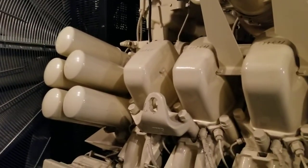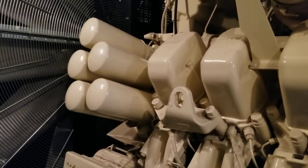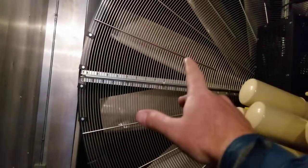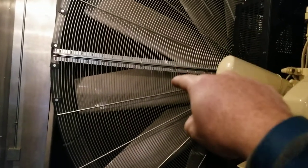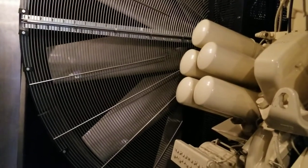Three megawatts is enough to feed probably at least 300 homes with all lights on. In the front we obviously have the radiator and the radiator cooling fan. On generators the fan always pushes through the radiator outward, because they're trying to cool the engine and alternator at the same time.